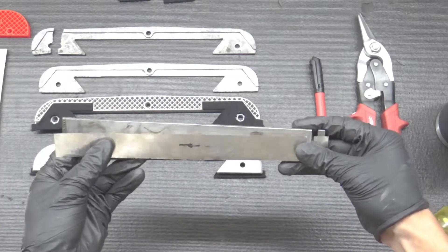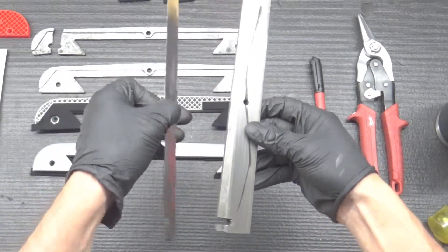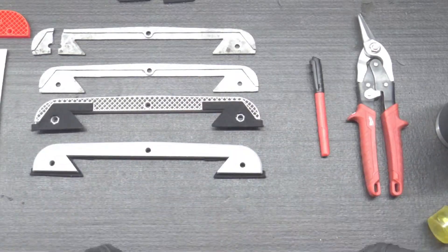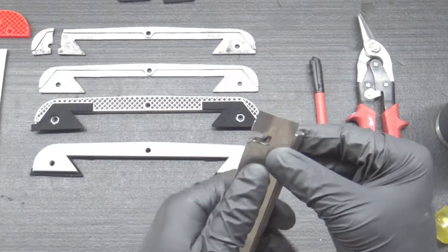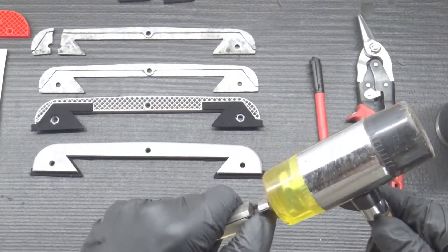Before any new covers can be put on, I actually have to adjust the gib so it doesn't protrude into the saddle. The way we're going to do this is by adding some shims to the back of the gib — the non-contact slide side — so this won't make contact with the dovetail. It's simply going to take up space and prevent the gib from going back too far during adjustment.